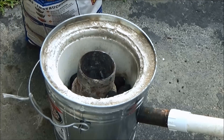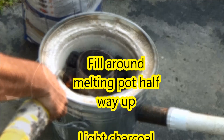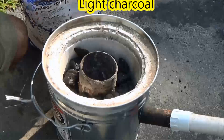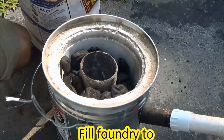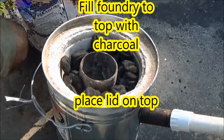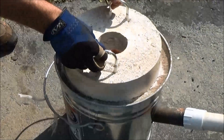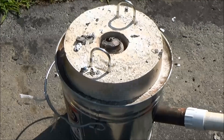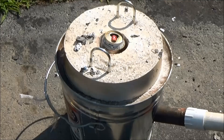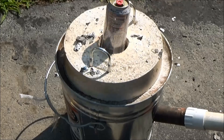The first thing you're going to do when you're getting ready to light your foundry is put some charcoal on the bottom, enough to bring your crucible almost up to the top. Then you're going to fill about halfway up your crucible with charcoal and light it — here I used my propane torch. You could use regular charcoal lighter or even match light charcoal. Once the charcoal is going, you will fill the foundry to the top with charcoal and place the lid on top. Next you're going to turn your hair dryer on to the low setting — you will not ever need to use the high setting; the low setting will produce plenty of heat. Once your crucible is starting to glow, you can start adding cans or other aluminum items. As you can see, it doesn't take long for them to melt and turn into aluminum. Be very careful when adding cans or aluminum to the top because the heat coming out of that top hole is amazingly hot.